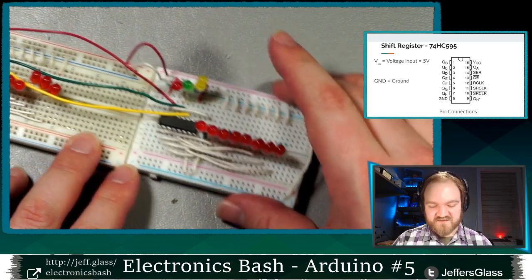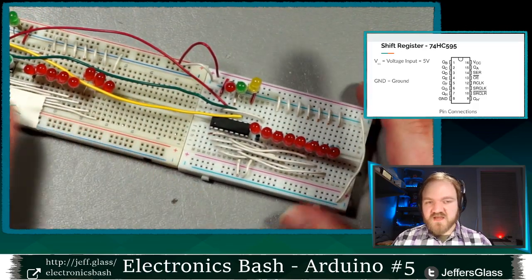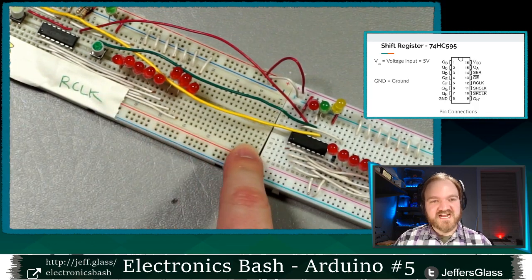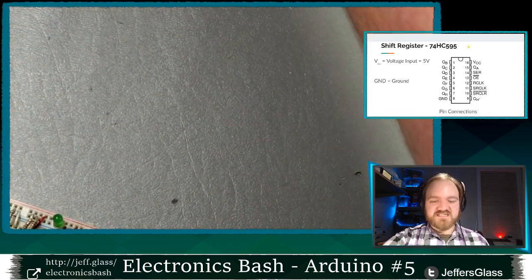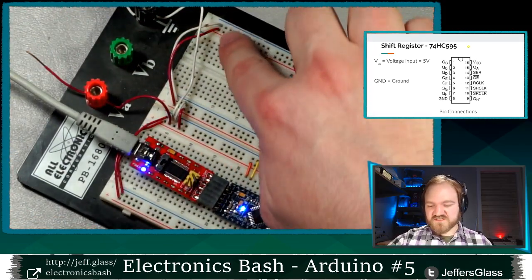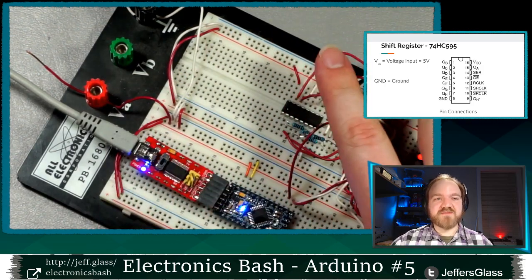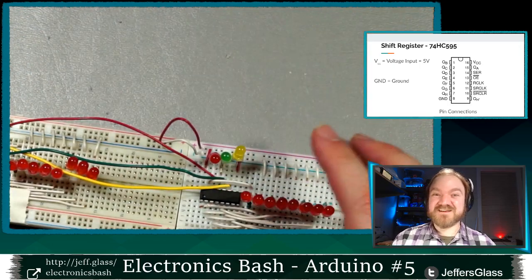So I have this white wire on this one and this sneaky white wire on this one connected to both my grounds. In both of these situations, I didn't need any power on this side of my breadboard, so I didn't jumper the power between the two. But when we get into later examples with more breadboards, you suspend some wire to jumper the connections between breadboards where you need the power and ground to be the same. So no, by default, they are not connected together. Good question.